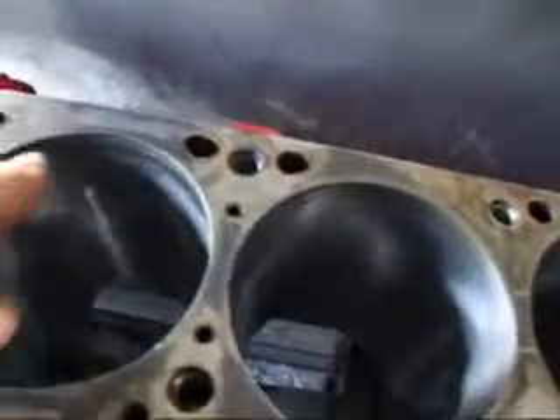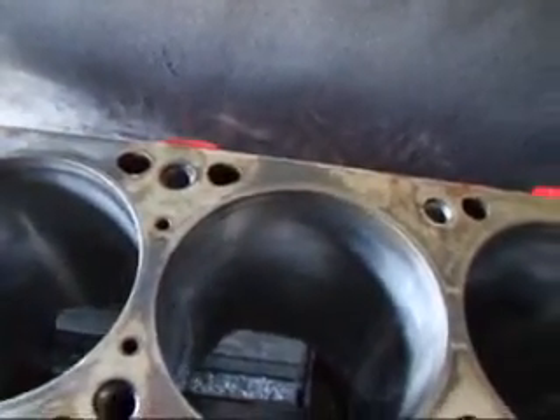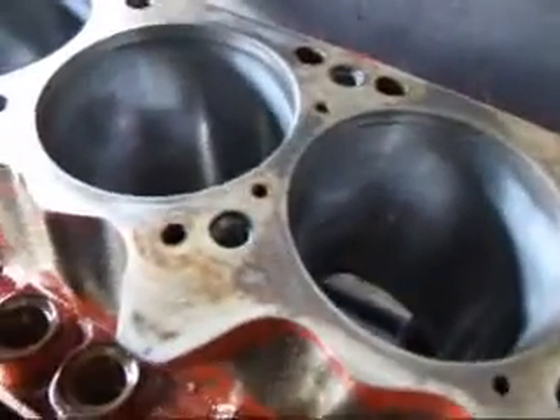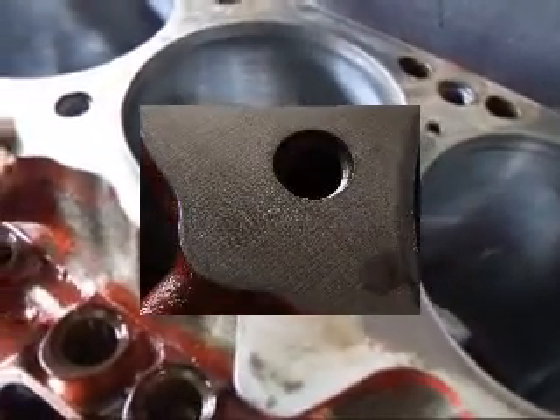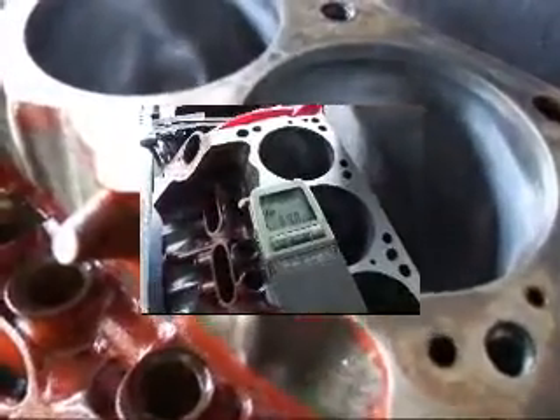As you can kind of see, we have some dark edges where we can see a little bit of blow-by has gotten past the gasket. We can also see — and I'm going to have a picture of this — a fairly rough surface. We measured the surface already; it was about 69RA.